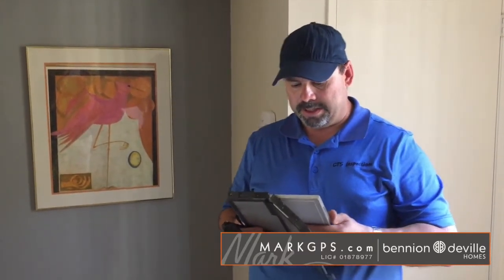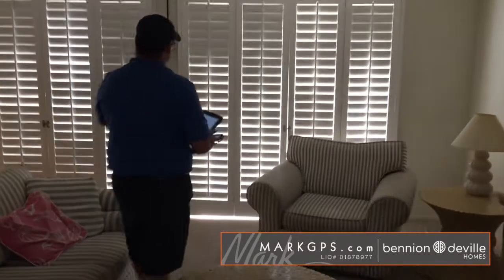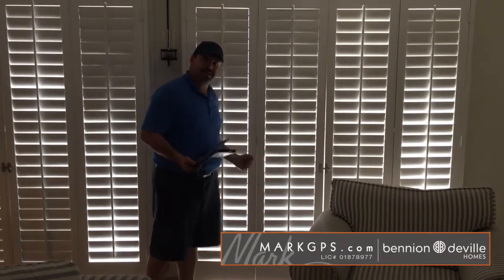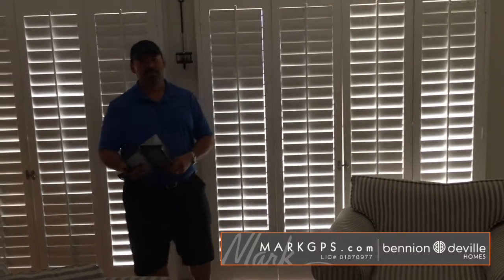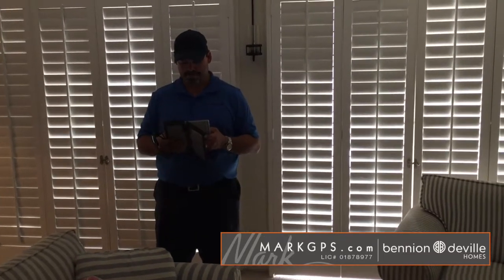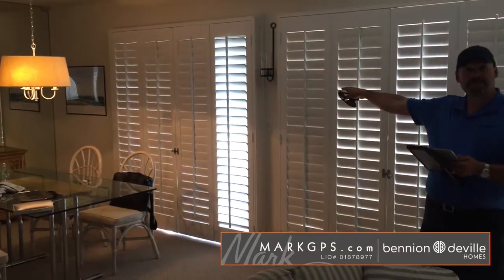Let's see, the north slider door in the living room, which would be this far right one if you're staring outside into the backyard. Same thing that's going on with your slider screens. The casters are damaged, and this one's really difficult to open and close. I think they probably collapsed. You may need some new casters for the slider door. I usually direct people to True Value. They have a lot of those. And then the sliding screen door in the dining area is missing.